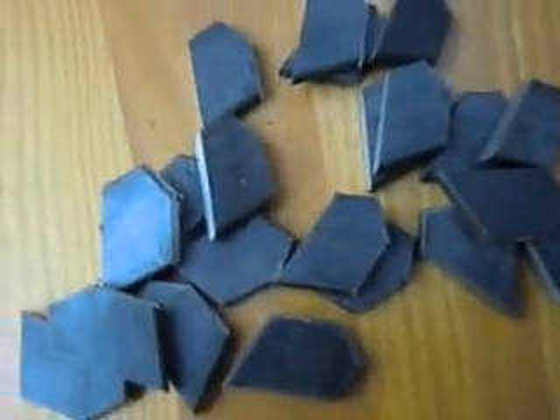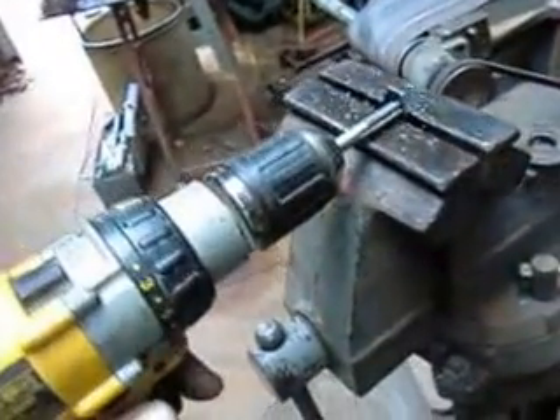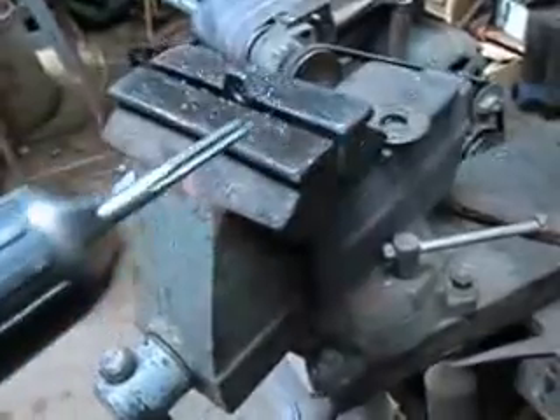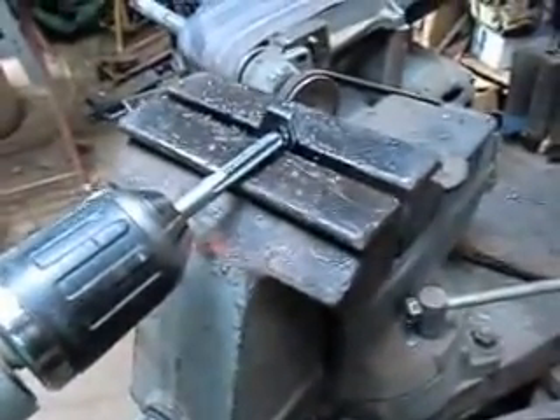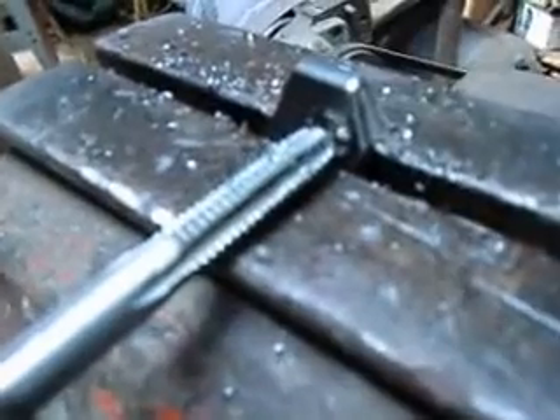So that's the next step in that process. We've got about 15 of them here and another 10 or so to go. Then we go in and grind off the edges, round them off, and make them look nice. We'll drill a small hole into the tab using this little jig I built — just a bit undersized of 5/16 so that we can tap the hole — and then drill another one that's at 5/16 exactly. Tapping the hole is pretty simple using the little DeWalt, since the hole is just slightly undersized for a tap, it goes through pretty quickly and easily. We don't have a whole lot of pressure against the threads so they don't have to be a full thread.